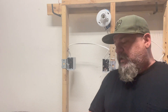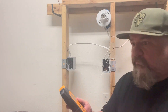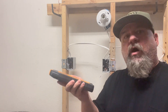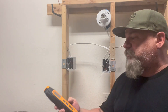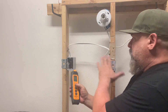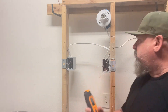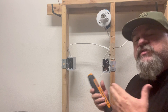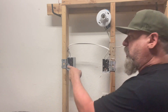The receiver also has a sensitivity meter — I think there are four or five settings. With high sensitivity, you can trace wires inside a wall without power on, reading through drywall and wood. However, you wouldn't have sensitivity all the way up when wires are bundled, because the pulse can get mixed up between stapled wires. The signal is still stronger on the target wire, but when it's too sensitive it tries to read everything, so you adjust accordingly.